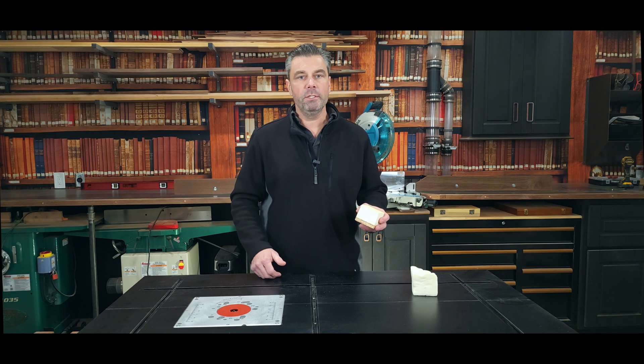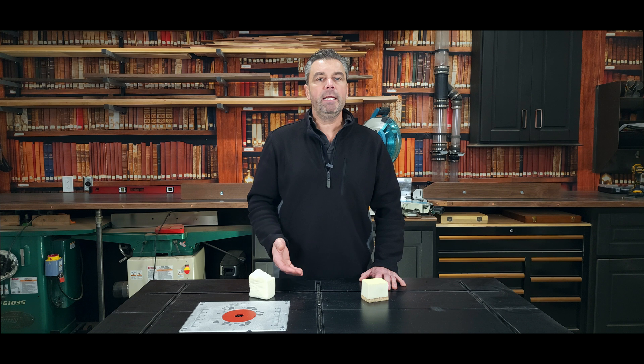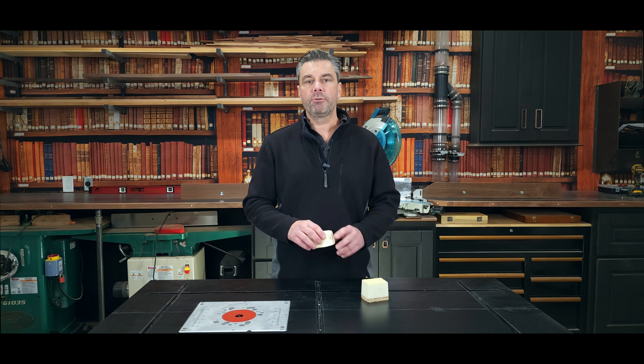There is a limit there. Sometimes you may not want to go further than four or four and a half inches. That extra two or three inches that you're paying for may not help you as much as expected. A lot of people think that foam can't possibly help with the structural integrity of the building, and when you're talking about open cell foam, that is 100% true.